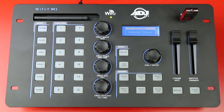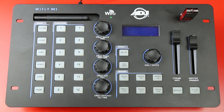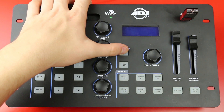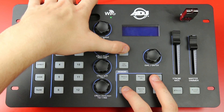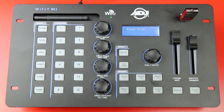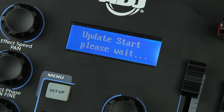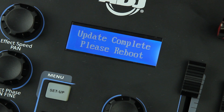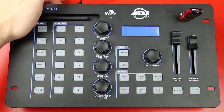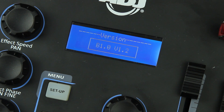To upgrade the firmware, first power off the controller with the switch on the back. To do the upgrade, hold down the setup button along with memory buttons 3 and 4, and then re-power on the controller. You'll see it now says 'load file,' then 'update start please wait,' and then 'update complete please reboot.' Power off the controller, power it back on, go into the setup menu, and we are now running firmware version 1.2.